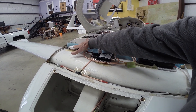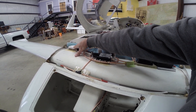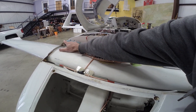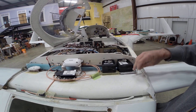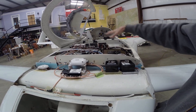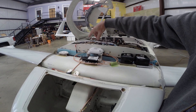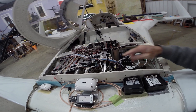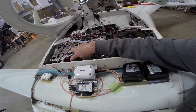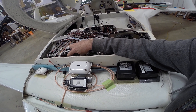Here's the Dynon GPS 2020 satellite receiver. These hinge pins pull out and release the front instrument panel cover. There are five — actually four — screws that hold the cover on as well as the pins. For the NavCom, I've got an IFD 540, and its antenna is closer than six feet of cable length away from the unit, so I have to have an attenuator to reduce the signal into the front end of the NavCom.